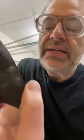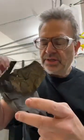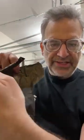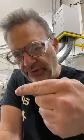These are pre-made envelopes, laser welded on 3 edges, so you just have one opening. Then you roll up that opening. I would do a really good job on that with pliers, 3 folds, 1, 2, 3, pinching it every time with pliers, and that's my procedure now. No more messing around with stuff in the bag.